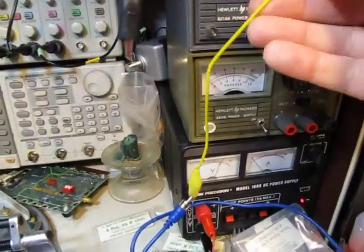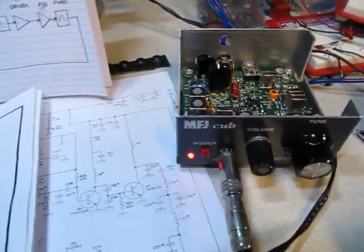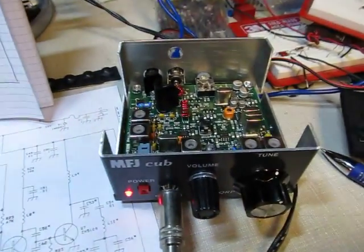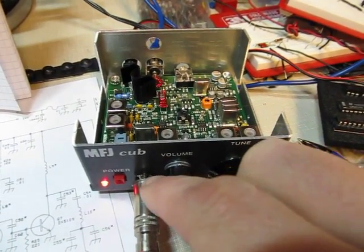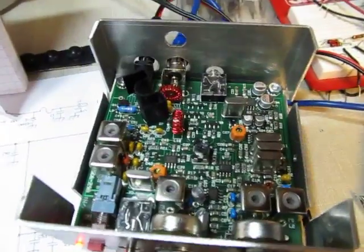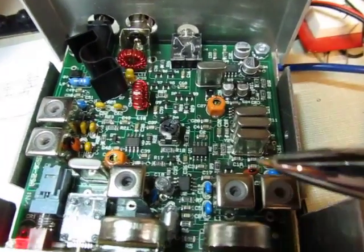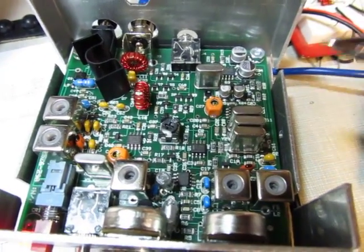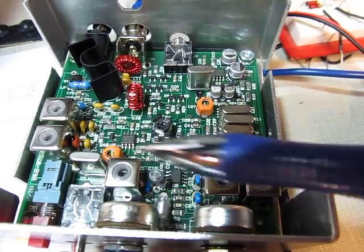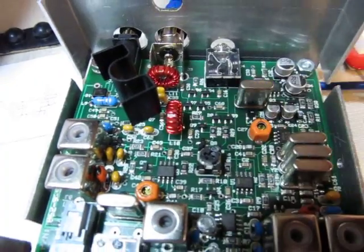That's literally this little alligator wire here — that's my whole antenna, about a foot and a half long, sitting in the basement, and able to pick up these signals pretty clearly. The kit's really nice, it's an easy one to build. It really just took me one evening to assemble. All the surface mount components on the kit come already assembled, so you're only putting in through-hole components, and there's only two toroids to wind.